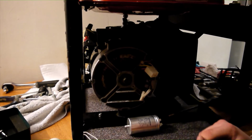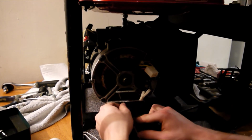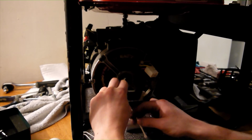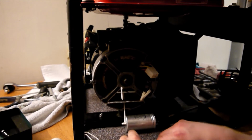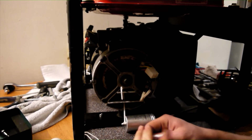Start by routing the cable ties around the back of the frame, then closing up over the capacitor body. Do not be tempted to poke or prod anything metallic into here to help, as doing so could damage the lacquer or the insulation on the windings.